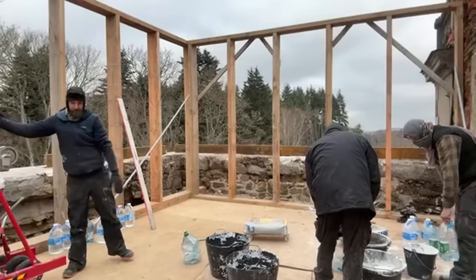Just saw a comment there, why we're not drilling the beam in. It's a good question. And the problem is that these top stones are granite, and granite fractures super easy. So if we start drilling a big hole to put one through, there's a chance that we could hit a fracture line and crack one of these top stones, which obviously would be pretty much a disaster. So the plaster is going to hold everything in place, and then the way the whole frame's braced will mean that these bits are pulled. Well, you'll see.